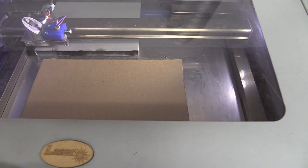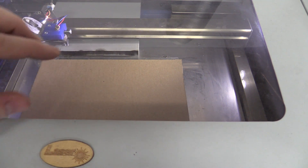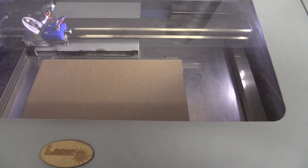So you need to add a little more power to cut it, but it cuts much cleaner. I'm using a power of 18 percent on the machine and a cutting speed of 18 millimeters per second. I try not to get that too fast because the machine can oscillate a little bit, and this is very fine stuff so we want it nice and precise.